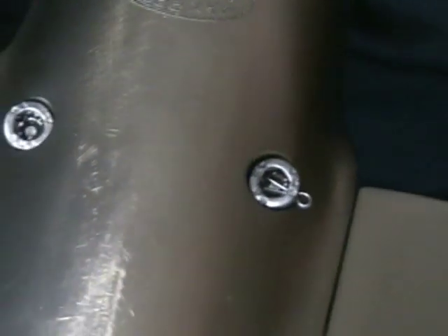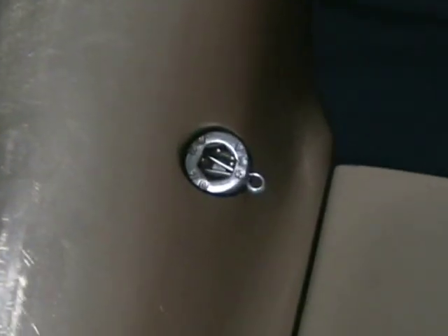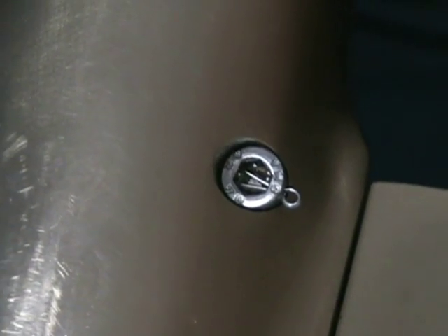Place a nut or a screw at the outside of it and pound on the head of the cotter pin. By pounding on it, it will spread out the legs of the cotter pin, opening up so that the cotter pin will not fall out and the screws will not loosen up.